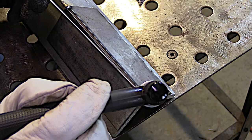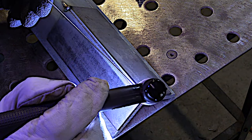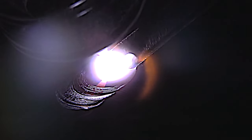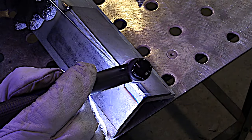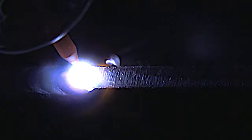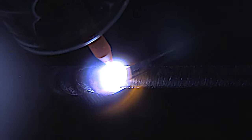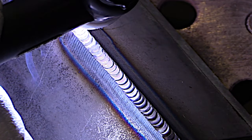Backing is great — you can't always use it, but I use it whenever I can. I keep pieces of aluminum scrap in a bucket: blocks of aluminum, aluminum angle, aluminum bar stock. It prevents distortion and pulls a lot of heat out of the metal. I'll go to quite a bit of trouble to put chill blocks on the back side of a weld and on either side when I can, though sometimes it's just not practical. For 18 or 20 gauge material, chill bars and backing make a huge difference — not so much for discoloration, but really for distortion.